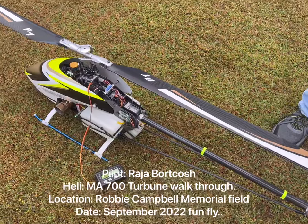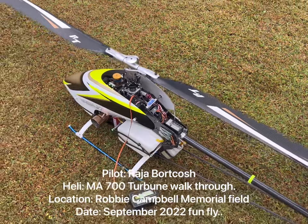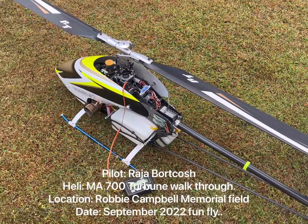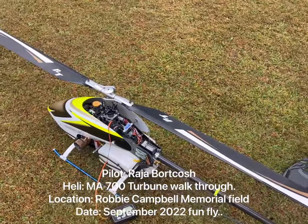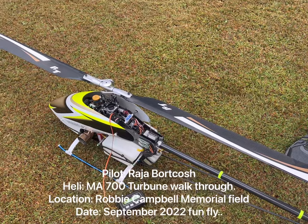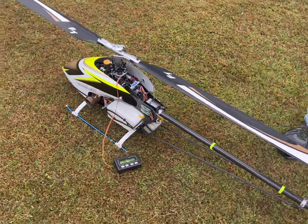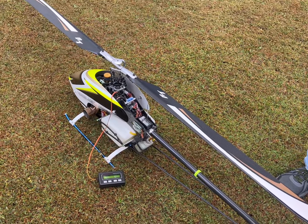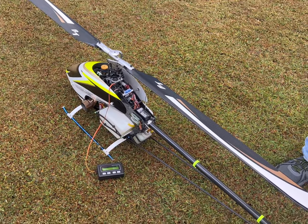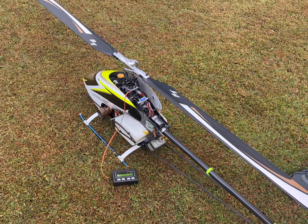Light the burner. First, it runs the starter motor to clear out any fumes inside the engine. Then it lights the burner and waits for the burner to get hot, like 6 seconds. Once the burner gets hot, it starts to turn and crank the starter motor, and it starts feeding in kerosene. Once it verifies that the temperature is rising and there's ignition, it speeds up the starter motor to 12,000 and waits for the preheat.